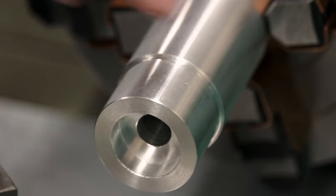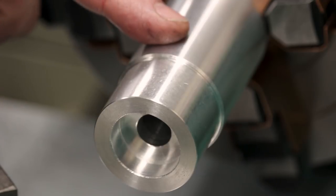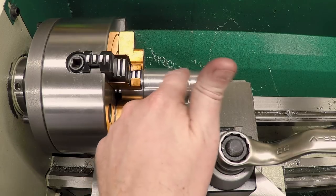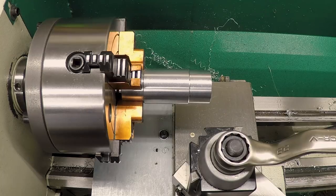Okay, so I had to think about the inside of this, and I've measured it, and it's very close. It's just roughness that's actually the issue, because technically it's like 501 to 502, which is exactly what I expected from a drill, to be slightly oversized. But the rods are exactly 500, maybe 1/10 over, maybe 2/10 over.